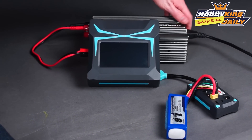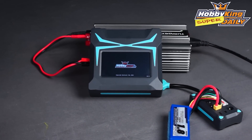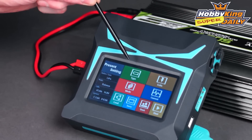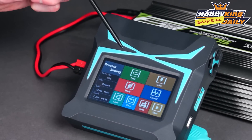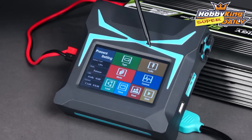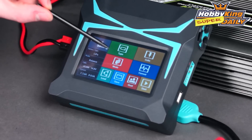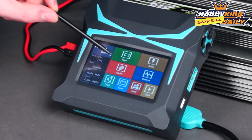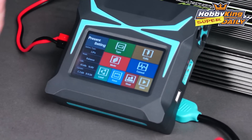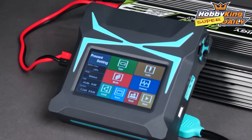So let's just turn that on. Here's the startup screen, and now we're at the main menu. You've got your battery type where you select your cell chemistry — nickel metal hydride or lipo, for example. You've got your cell count here where you select the amount of cells you're wishing to charge. You've got your mode, be it balance mode, store mode, whatever mode you would like to choose for your charge setting. And then current, which is of course the charge rate that you want to charge your battery at.